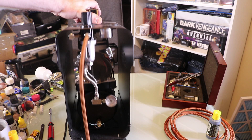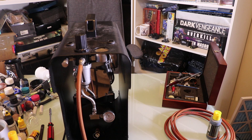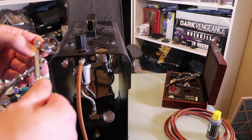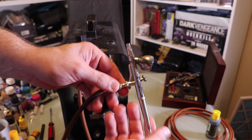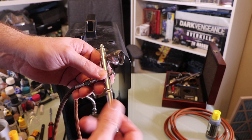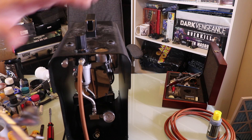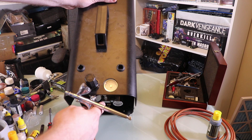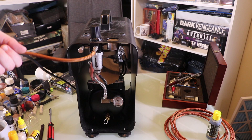This big one here — this terminator — is the master. I love this one. It's a very heavy duty compressor. Not only is it heavy duty, but it has its own ballast. What it means is the other compressor I showed you will just generate air continuously, but this one actually has a storage tank. That's your ballast tank — your storage tank. So your air gets generated here and then it actually stores your air down there, so you don't have to keep the motor running. It's actually a lot quieter, which is why I bought this unit. It only makes noise when it loses compression — once you charge it, it might take like 30-40 seconds to get a full ballast of air.